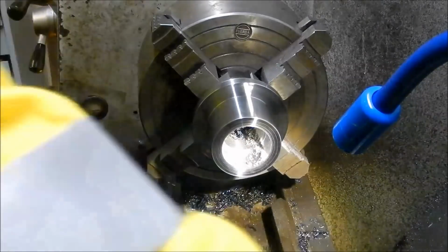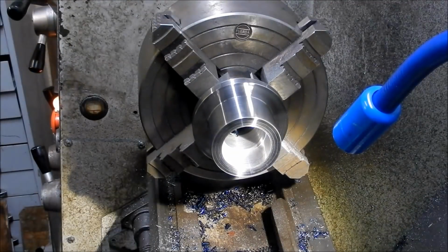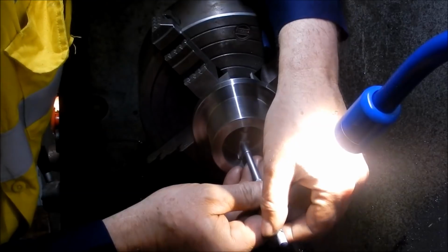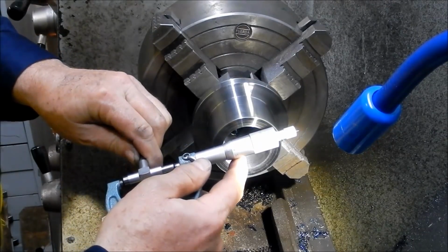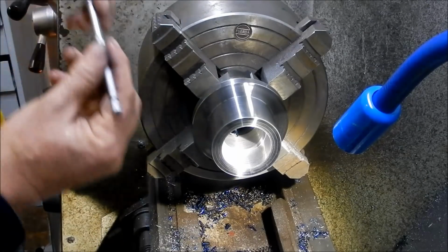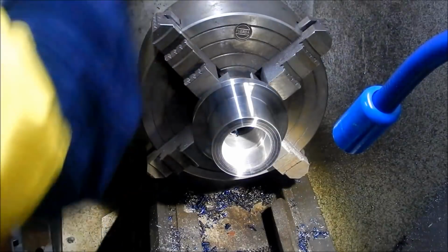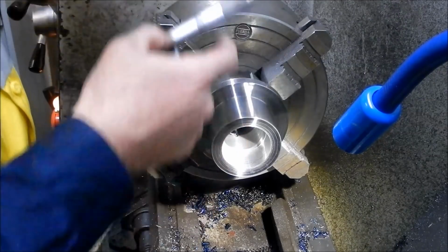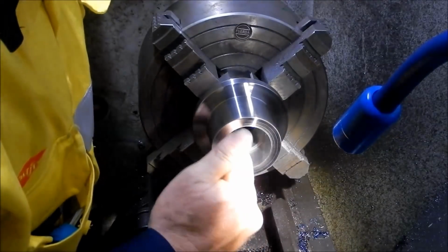Oh, well, hopefully we're there. So we're machining the seat down to depth at 27mm. Let's give it a scratch. Like that. Check that again, that's as if it's moved. It certainly moved. .97 of a mil to go, so I'm just going to take that out with a bit of emery. That'll do me, I think we'll be right for that.